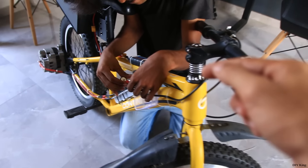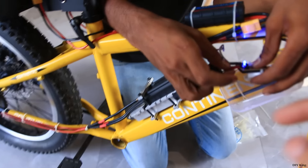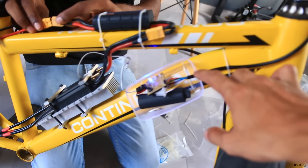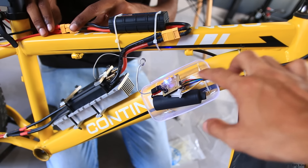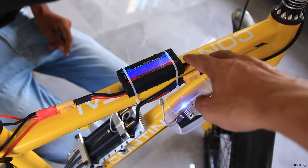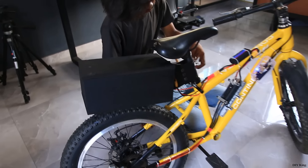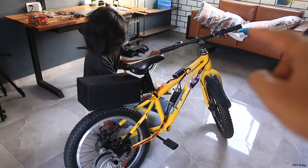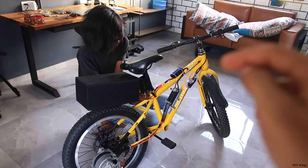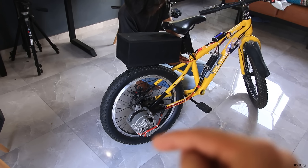With the throttle assembly mounted, the next thing we are going to need is a lithium-ion cell that's going to provide the signal from the throttle to our speed controller. Since this speed controller does not offer an on-board battery elimination circuit, we are going to need an external source to power our servo tester. We also have a watt meter that's going to determine the amount of power this whole setup is drawing from the 1.5 kilowatt-hour lithium-ion battery pack. The throttle provides voltage from 4V down to 0V to the servo tester, which provides the required pulse-width modulation signal to our speed controller, and that speed controller drives our alternator using power from our lithium-ion battery pack.